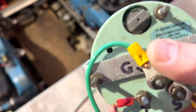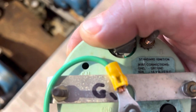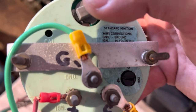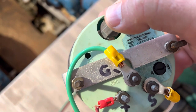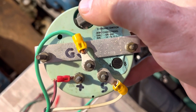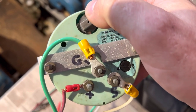What's cool about this tachometer is right here above the little green wire by the 'G' — that little hole says CAL, which is your calibration port. Inside that is a tiny standard screwdriver slot. You'll need basically a little eyeglass tool kit, because it requires a small flathead or Phillips. If you've got an additional tachometer you can put down in the engine room to pick up a live reading — whether it's crankshaft-driven, manual, electronic, uses a piece of tape, or hooks directly to your coil — you can use that to calibrate.